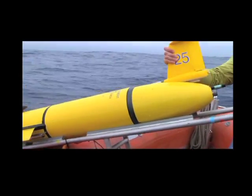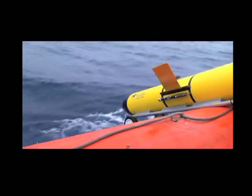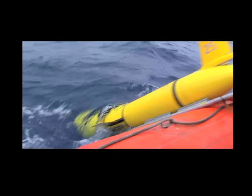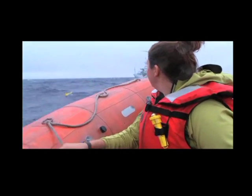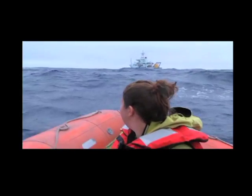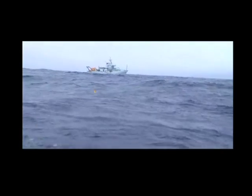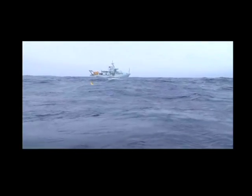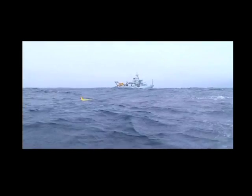You can see the cart then just gets lifted at an angle, and we let go of the glider, and it'll just go sliding right in, and that'll start our mission. We'll then hang out on location and wait a little bit to make sure that our test dives go well. One of the missions is called an over-depth mission, which is just checking the ballast of the glider to make sure that it will not only dive but resurface, which of course is extremely important for our mission to go successfully.